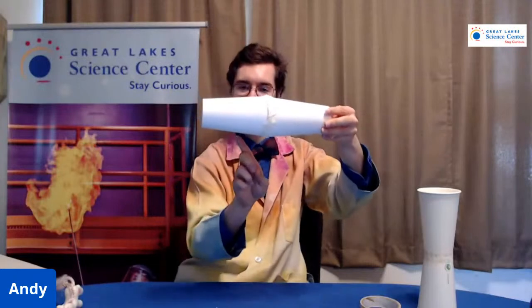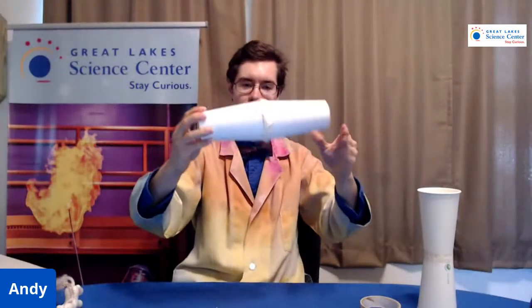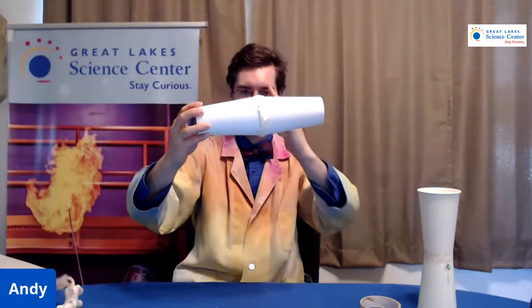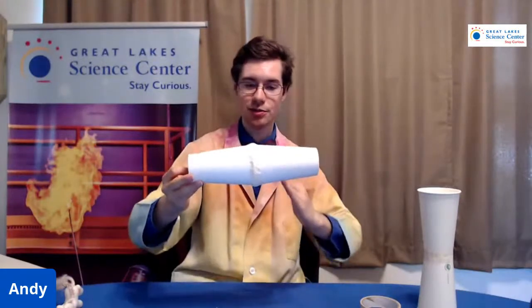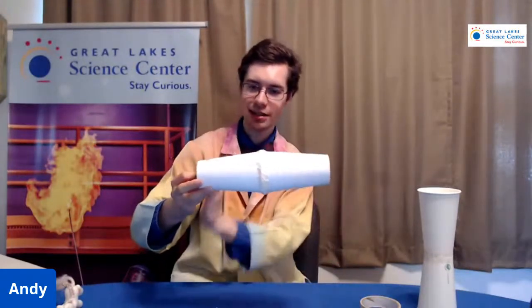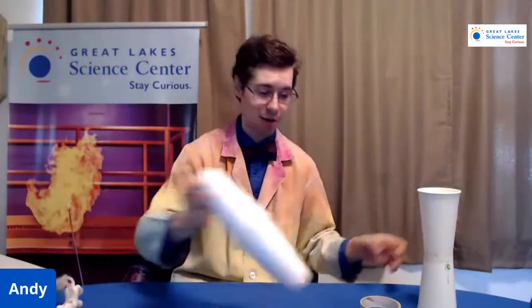This does work because the tracks are pushing in, and that inward push is able to keep the train, made out of paper cups, on the track. So both tracks were pushing in and keeping this wheel set on the track. So there you go. That is why trains are designed to have wheels shaped like little hats with the wide part on the inside of the track.